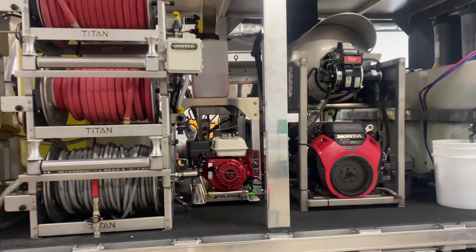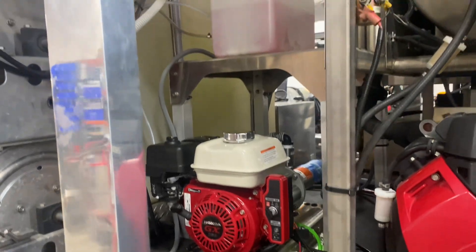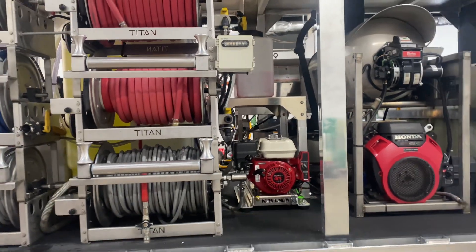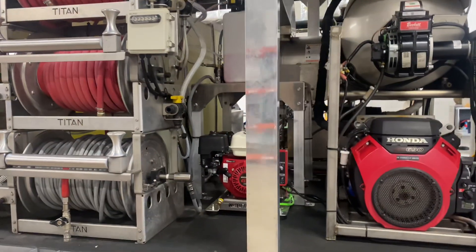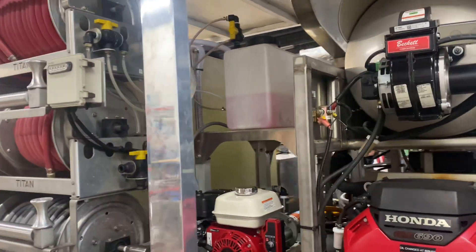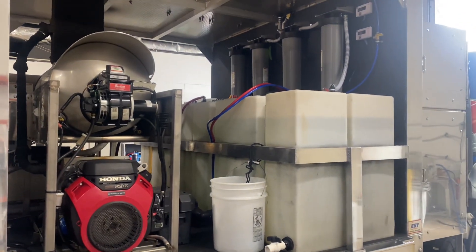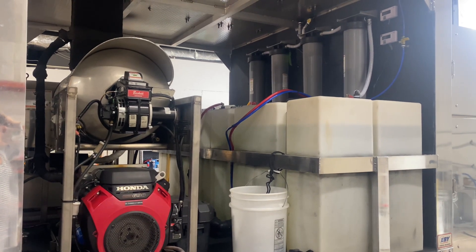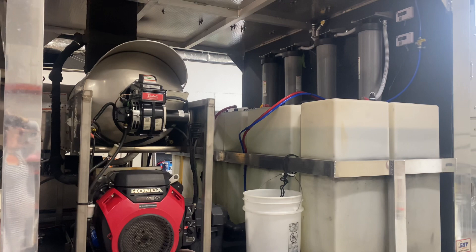Part of the system is going to be this booster pump. The booster pump is going to be fed with a garden source. Over on the other side we have a ball valve for priming. That booster pump is going to pump from this 100-gallon tank here. It's going to process the water and send it through these filters — the first two being a carbon and a sediment filter. Then it's going to move the water up on top of the deck, which I'll show you those filters in a second.